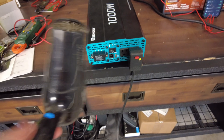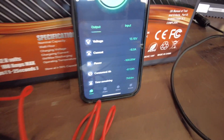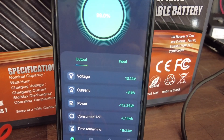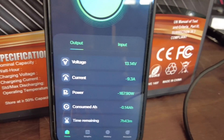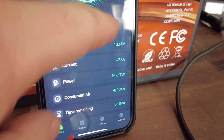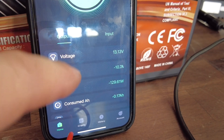When it comes to solar charge controllers, this is just an older PWM but I really recommend MPPTs because they're just that much better. We're going to do a little test — I'm going to use this hair dryer in fan-only mode, which will be about 125 watts give or take. As we look at the phone we can take a look at the app and it'll show information like how much current is being drawn, the amount of watts, and estimated run times. You can also see temperature, which this one does come with a temp sensor unlike the Victron model.